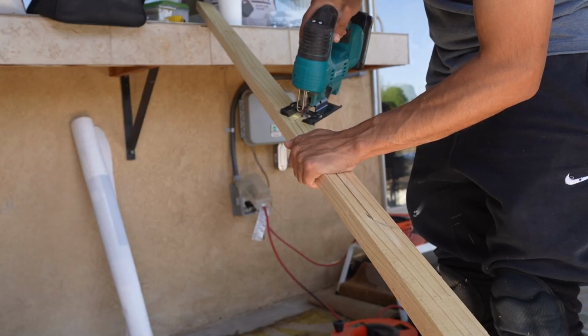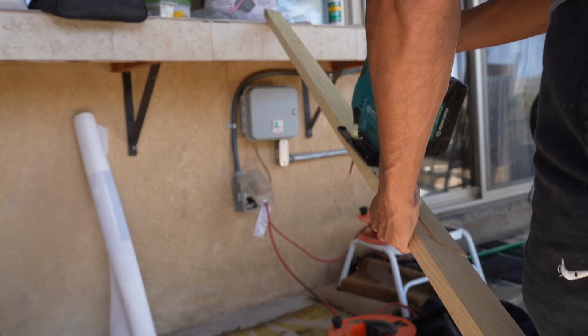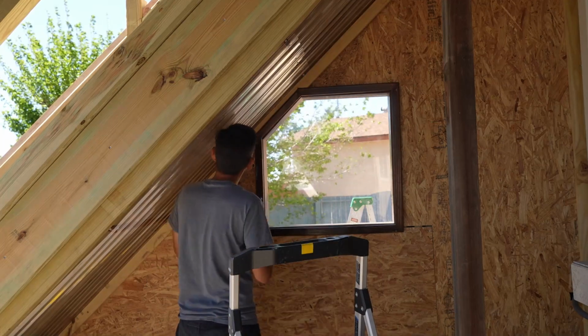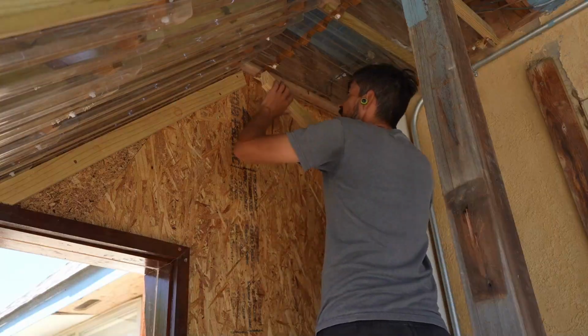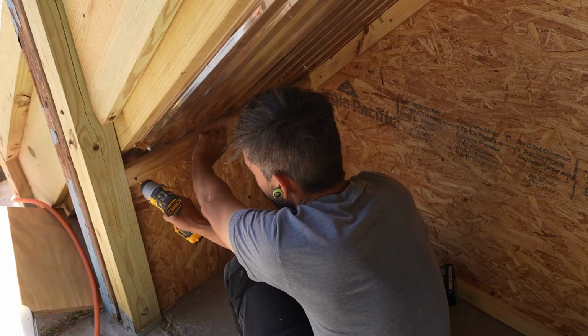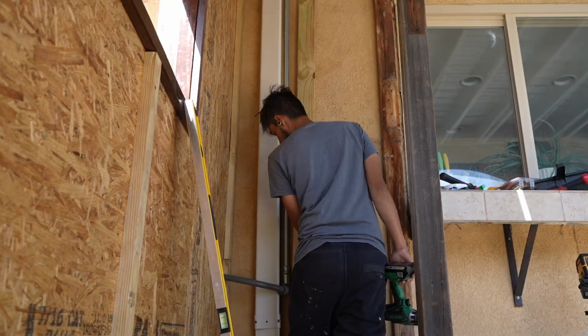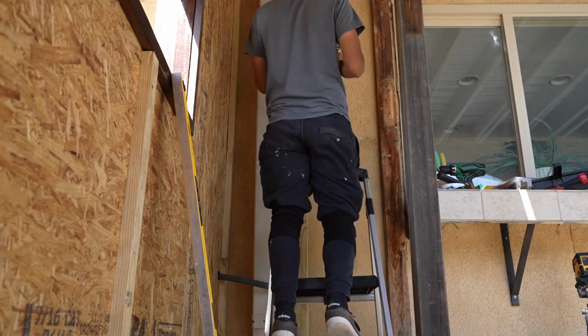To finish off the nook, I thought it would be a nice look to continue the siding theme from the outside facing wall and continue that into the inside facing wall with the same siding. Only difference being that I wouldn't overlap the boards, since in theory there wouldn't be any water under here. So instead I would just mount them flat against the sheathing.